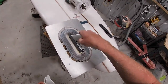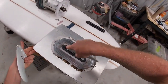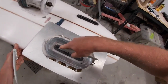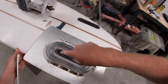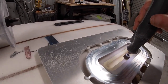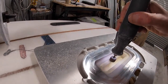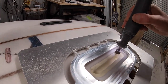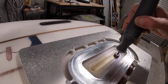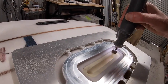A quick note - always make sure your router bit has stopped spinning before you remove it from the jig. They're scary tools and I don't want someone hurting themselves or screwing their board up. Turn the router off and make sure it stops spinning before you lift it up. Because we're essentially doing an install post-laminate, our glass is pretty tight, so just running the Dremel along the edges here until it fits. It might take a few attempts - you don't want to take away too much glass, but you want the box to be able to slide in with reasonable ease.